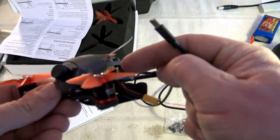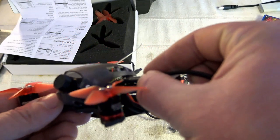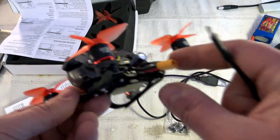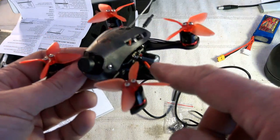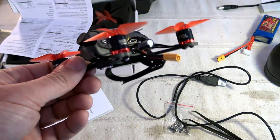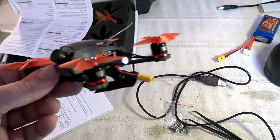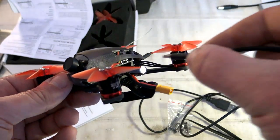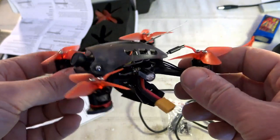More, you will need to bend the condenser very gently and slowly to be sure not to break it. This one is soldered in parallel to the main lead power. We have an XT30 connector. So that's great, it's helping a lot, and be aware, during a crash, it can pop up, be ejected, but it would be really bad luck to crash it. The main problem for the condenser is that with multiple USB insertions and ejections, or battery insertions, you can probably damage it several times.